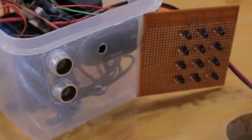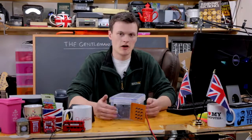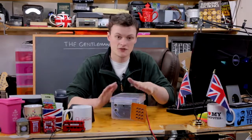Now that we've looked at the software and hardware, it's time to put it all together into its box. I've cut out a few holes in this box so the camera can see out and the ultrasonic module can detect nearby objects. I've also glued the IR floodlight on the outside of the box so that when things pass by in the night the box can see it. With this built, all we have to do now is go outside and test it out.